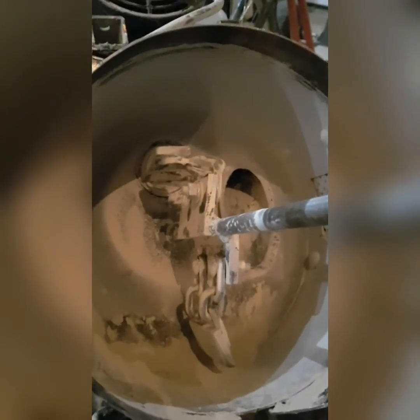It's easy enough just to take these chains off — 3 links of chain. Weld on some more 3/8 steel and I'm ready to roll again. Takes no time at all. That's about it for my video.